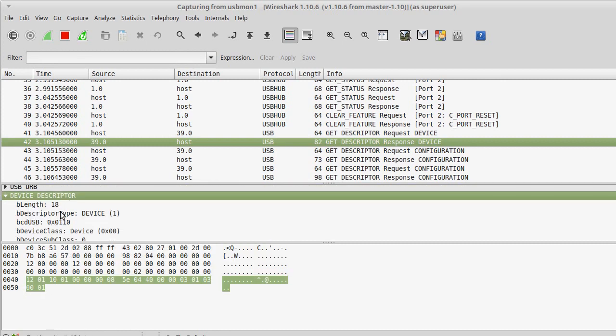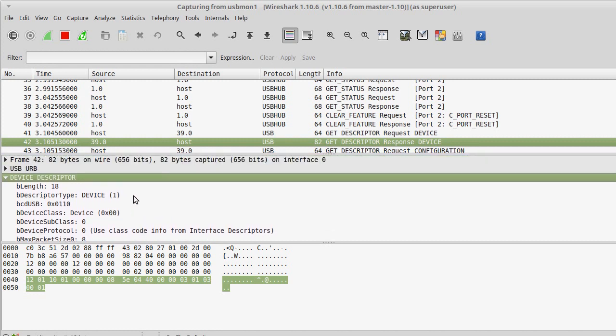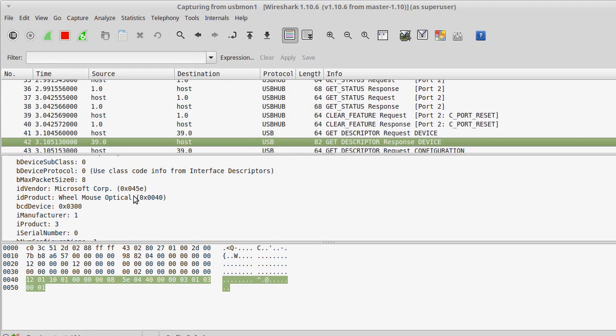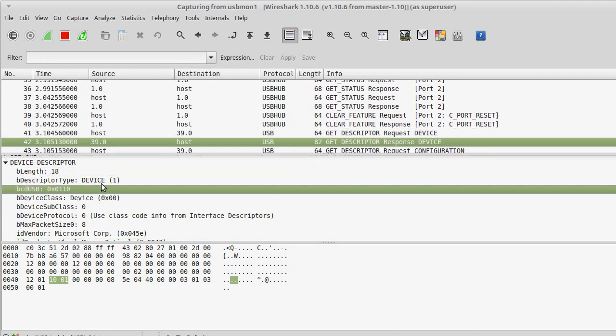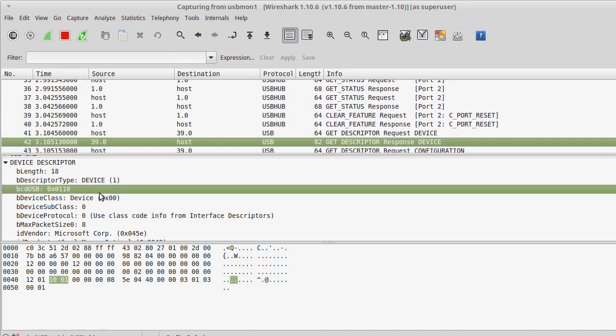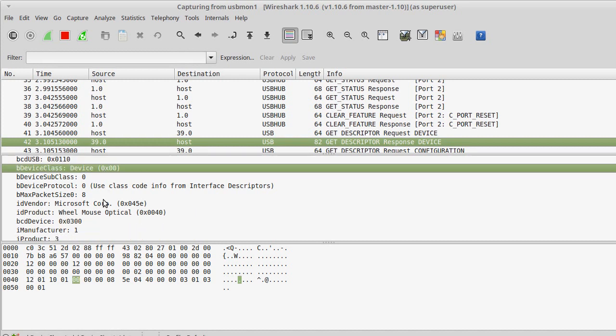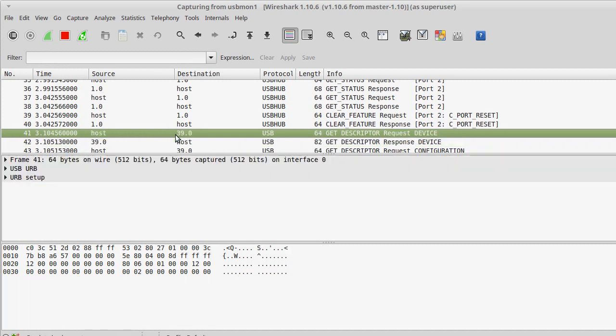And Wireshark is amazing for this sort of thing, especially when you run it on Linux. It's great for packets, for debugging networks, all the way down to right here, where I'm using it to debug USB. It's just a great, great thing. At any rate, the descriptor comes from the device, and I was able to go look and say, okay, in real life, what do some of these descriptors look like? So I could just go around, literally, plugging in different devices and looking at their descriptors.